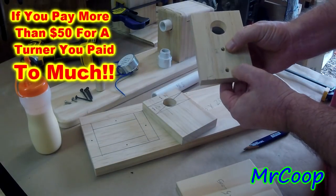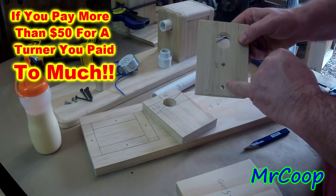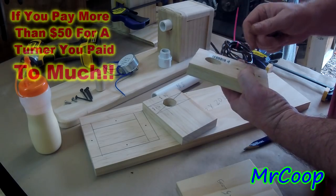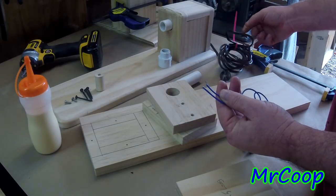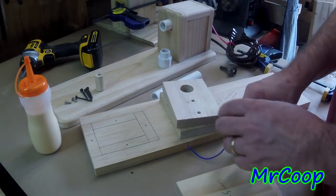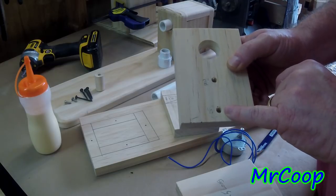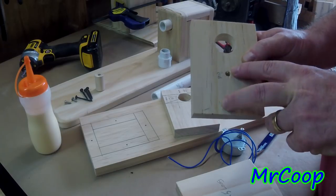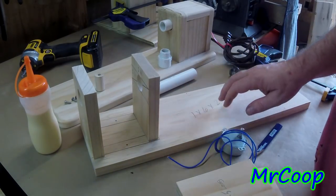There's one more thing to drill: you need to drill two holes on the back of one of the boards. This is where your blue wire for your motor goes in, and this is where your brown cord will go in — you'll wire everything up on the inside. It's very simple: your lamp cord will have two wires, you just wire the two together on the inside and your plug comes out the bottom. Here are your measurements: a half inch from the bottom drill a quarter-inch hole, two inches from the bottom another quarter-inch hole. That's just for your wires — this will be your backboard, the other your front board.